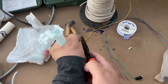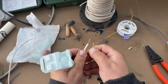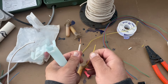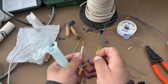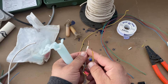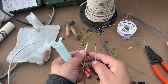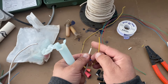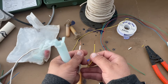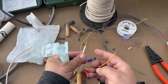This residential wire is about 18 gauge, not positive. This commercial one right here is 14 gauge, and the residential might even be 22 gauge — you can see the difference in thickness. The run at a home is a lot shorter. Commercial, for example in a park or golf course, they may be running hundreds of yards. They need thicker wire to carry that voltage that far. In a commercial setting, you want to keep everything standard with the larger wire.